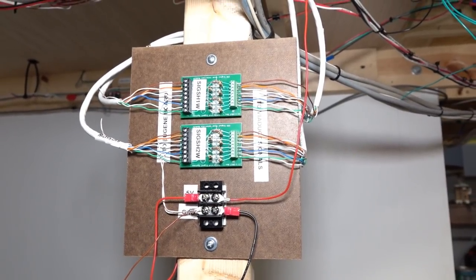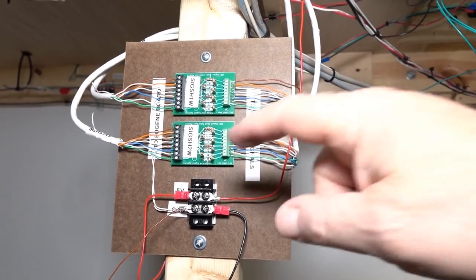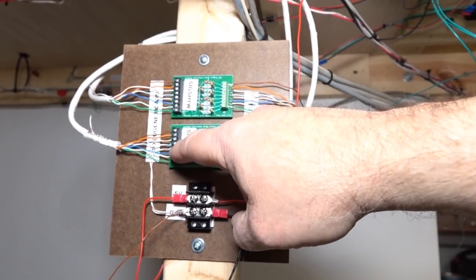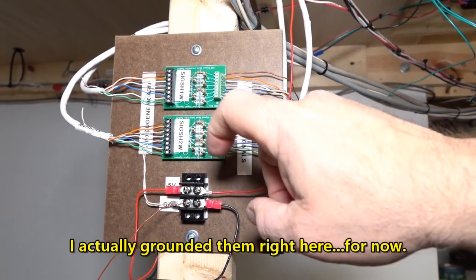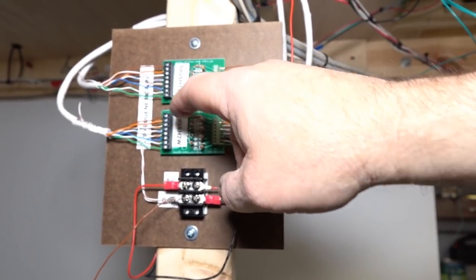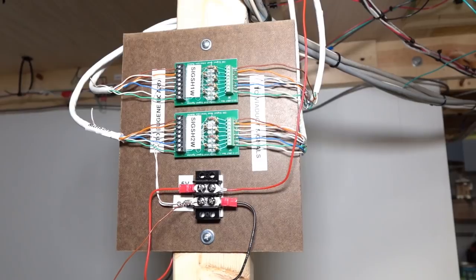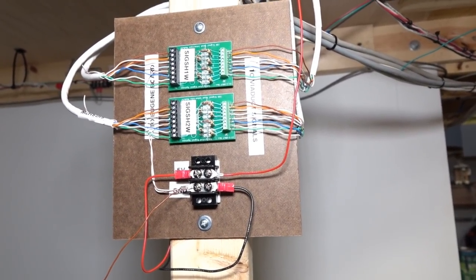So, alright, that's that. Again, all the signals were tested. Everything works good. What I'll probably do back at the CMRI board, you can see the 4 terminals are grounded. They're the centers on the top because they're always on. Back on the CMRI board, I can then ground the blues, the blue for the top, which is the red. So at least when it comes on for now, until I get the program done, it'll display a stop indication. Yeah, just something. So, all right, let's pop up and take a look at it and see what things look like up top.